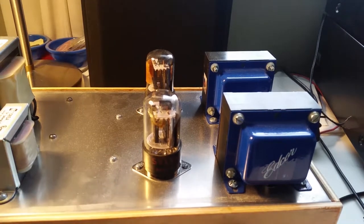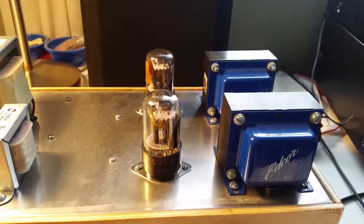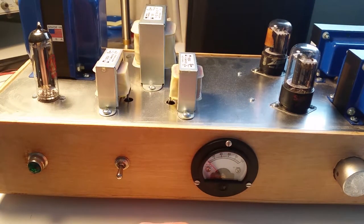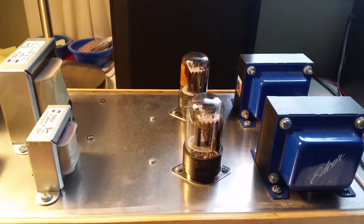This amp has no negative feedback whatsoever — it's totally wide open. That means if the tubes are mismatched at all, you'll have a difference between stereo channels, so you have to use matched tubes. I've gone through a few pairs because some had grid poisoning, and the only way I'd know something was wrong was because the meter was pegged. It should pull about 80 milliamps. One tube self-emitted and basically destroyed itself. The ones in there now are maybe 70–80 percent of spec, but at least they're matched and do the job.